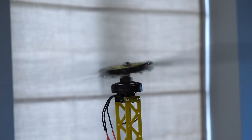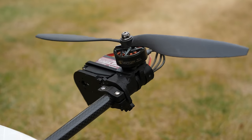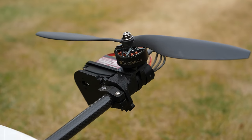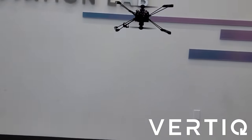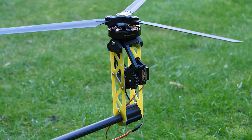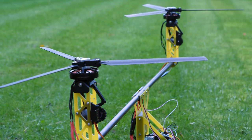Ultimately, I have to make a decision: are we building a strange two-rotor test vehicle or are we trying to build a V-22 Osprey scale model? From the title of this video, you know the answer. I really wanted to hold on to this freely hinged rotor head system, but in reality it's not feasible for this application. The final rotor head was the closest to success, but because it's essentially a thrust vectoring design, this can be achieved with a servo-actuated motor pivot instead - which has the advantage of being locked in position during forward flight. So I removed the hinged rotor heads and went with a simple servo-actuated motor pivot, using a small servo with a 3-to-1 gear ratio since the motors only tilt about 20 degrees.